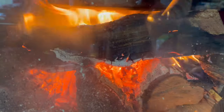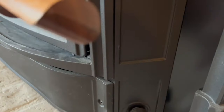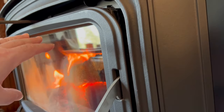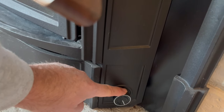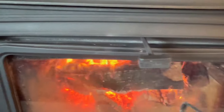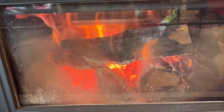As a side note, there's a fan here that you turn on to help push the hot air into the room. But if your bypass hasn't been pushed in yet, don't turn your fan on — it's going to cool the top of the firebox and make it less efficient. You want it hot enough to press in the bypass and get your catalytic converter running before you turn on your fan. So we're there — I'm going to go ahead and push this in. Don't use your hand; most stoves come with a tool, if not use gloves. When I push it in, it didn't fill with smoke — that's a good thing. If it fills with smoke, go ahead and pull it back out.